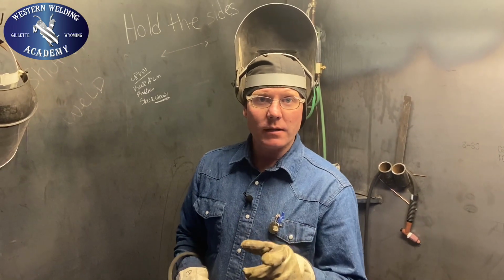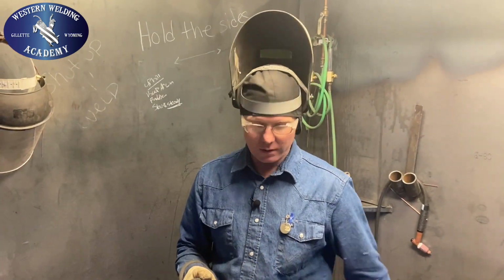Okay, we got our TIG bead, our TIG hot pass in. Now we're gonna switch to 7018, start filling this thing out.